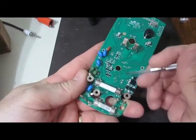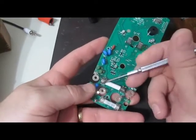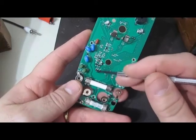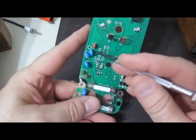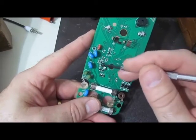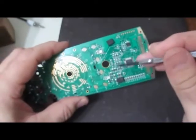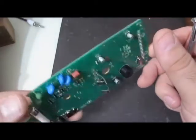Okay, so I checked out all the parts in this area and I don't see anything else wrong with it. When I fired it up, the diode check now works, and originally after it failed, if you'd measure the voltage between the two inputs, I was reading about 1/2 volt. After replacing the two diodes here, this goes up to 1 volt, which would be normal. You know, and I can look at that volt signal and I can see now that routes all the way through the MOVs, everything up through this protection, and unfortunately it goes up here and into our chip. So yeah, I believe I looked at all the values here, nothing shorted, all the resistors appear to be the right value, so it's unfortunate.